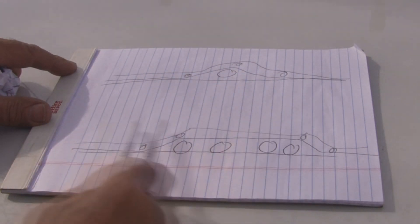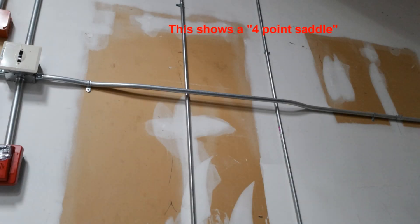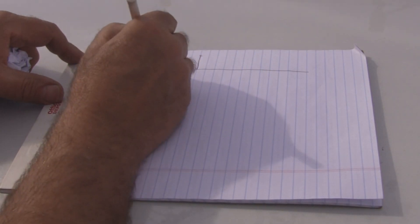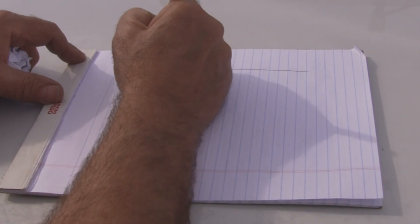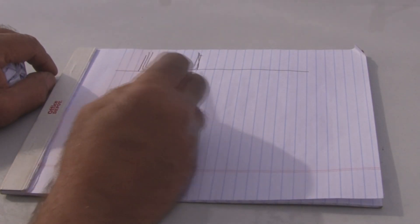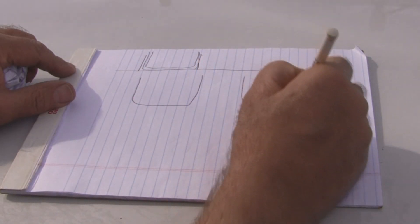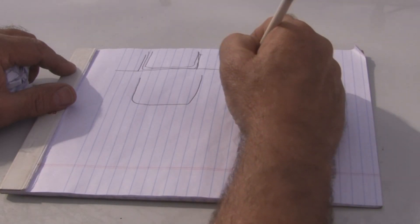There are videos on how to bend the three-point saddle. You've also got your back-to-backs. Say you've got a floor and a wall, and four feet away is a small closet — you're coming down like this, you bend a 90, and then when you get to the wall you bend a 90 back up. That's called a back-to-back. The overall distance is the back-to-back measurement. It can also be an S-shaped thing — that's also a back-to-back, and the back-to-back distance is the farthest distance to the farthest distance.